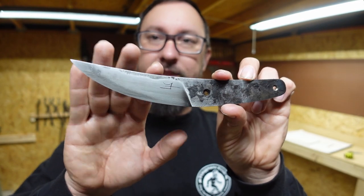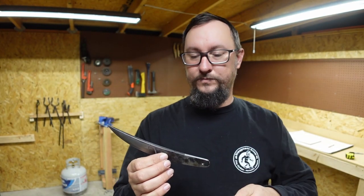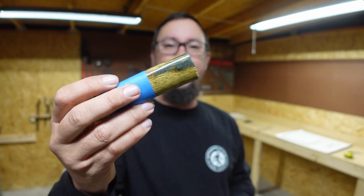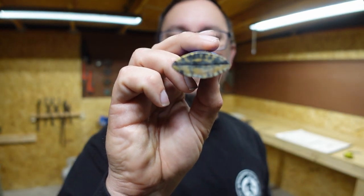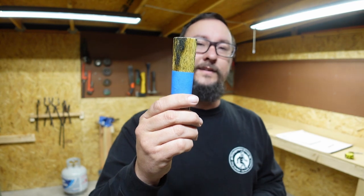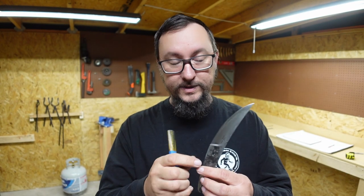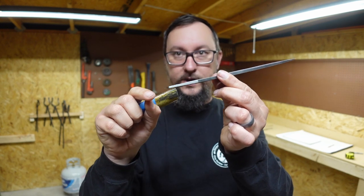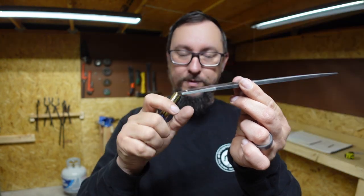That's a cool profile. Now, when it comes down to it, the reason why I didn't do the handle scales in this particular episode is because of the material that I'm going to use. I'm going to be doing camel bone. So stabilized camel bone. And with this right here, they are curved. So they're rounded. I wanted to make sure and dedicate an episode to being able to show y'all how I go through drilling the pinholes and everything for this. Plus, we have the added difficulty of a tapered tang. It's going to be even more tapered whenever I start grinding this down a little bit to make sure everything's perfectly flat for the scales. So we're going to have tapered tang, rounded scales, flat. And then we're going to go ahead and do that all in its own episode so that I can talk a little bit more without making this a 29, 35 minute episode.